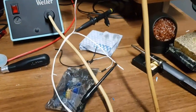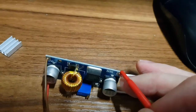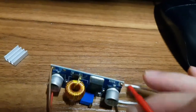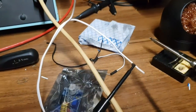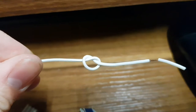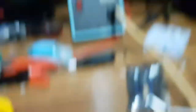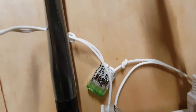It's important to find out which end is positive and negative. I've connected one end of the meter to one end of the lead, and if we buzz this out — that is negative. So that one's negative, and what I like to do is put a knot in there so we know which one's which. I've tied a knot in the cable so I know this is negative. I can now connect it to the block up there knowing which one's which. I've done a knot in the cable on the negative line previously, so I know that block is negative and that one is positive.